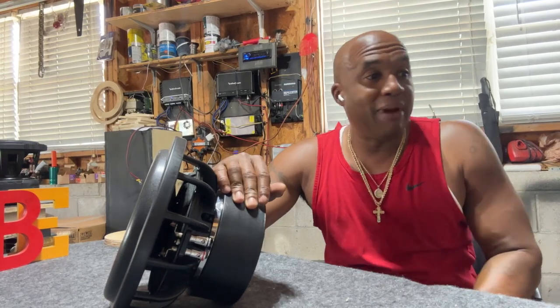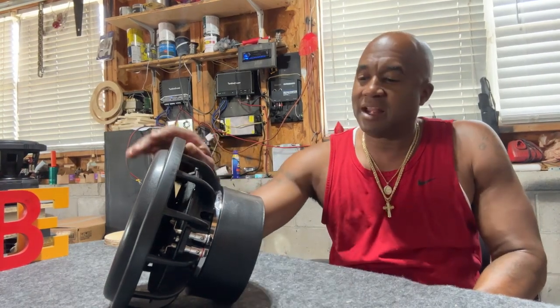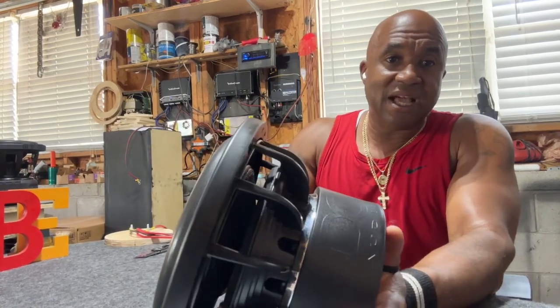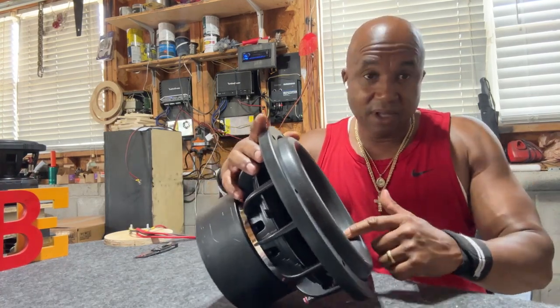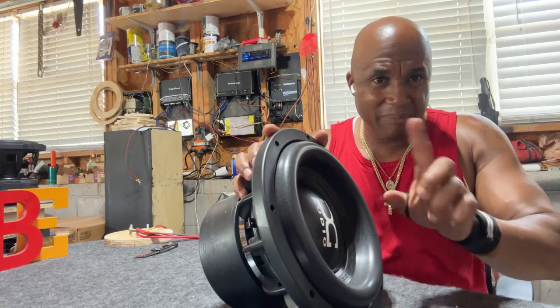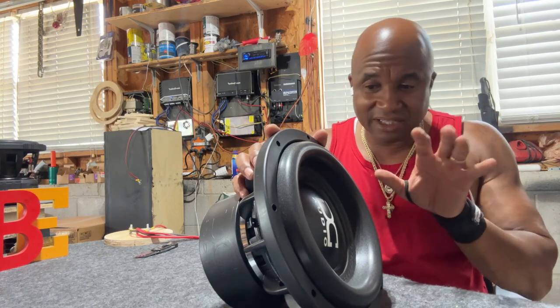FEA optimized motor assembly, fully CNC machined rubber gasket, chrome spring push terminals, 3-inch aluminum voice coil former on a black anodized finish — I know that's usually for heat dissipation and to make it non-conductive, so you want that on your former. A rubber magnetic boot embossed with the DC logo. I like the lip on this surround — this lip gives it the punchiness that I like.